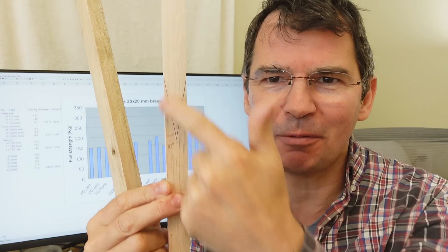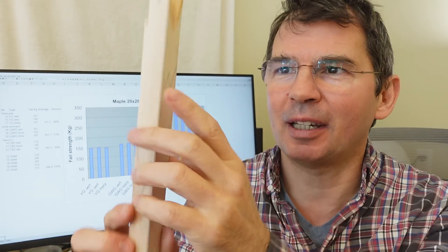I could have made the fingers a bit longer, but if the grain isn't completely straight, that can actually become counterproductive. With a 15-degree blade tilt these were not too difficult to cut and I can cut a reasonable thickness of stock. But given that I was only at half the strength with some of the glues, I should really make this twice as long — which would make a joint like this, getting to be ridiculous because the depth of cut needed for a modest thickness of wood is quite high. Going to 10 degrees might be workable for thinner stuff. I also thought about putting two of these side by side to make it shallower or go wider, but getting that lined up is just way too difficult. So this joint is about as good as I can do with the V's.